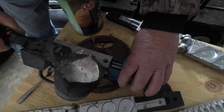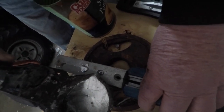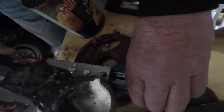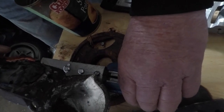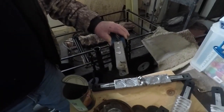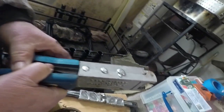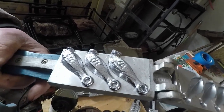Do the next one. Look at those steady hands — Dad, you should have been a surgeon. Keep a steady stream. You don't want to stop and make a hole in it. You don't want any air bubbles or holes — those are imperfections. Usually whenever you first pour the lead it will be a very shiny gloss. That's not bad for the first couple, but we got a little bit of imperfection in a couple of those. So we're going to throw one or two of those out — they'll get a little bit better as it goes. It still works, but it's not as good.